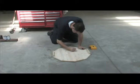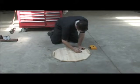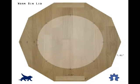The drip line will actually enter the bin at a corner in the lid. I chose one of the 2 corners that runs with the grain of the wood. Draw a straight line from this corner to this circle. You don't want your drip line to bend at a right angle, however, so free sketch in a gradual bend appropriate for your drip line, leading this straight line into the circle.